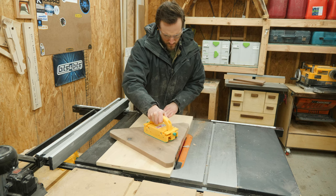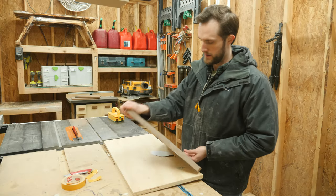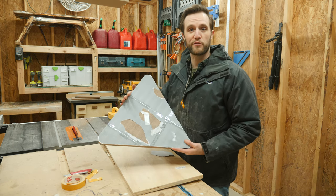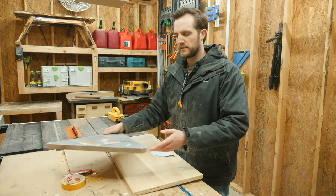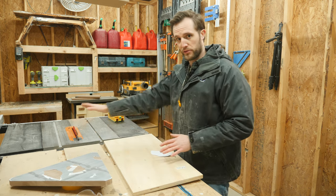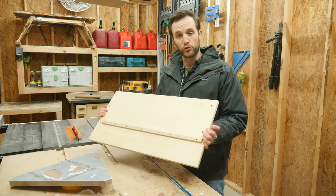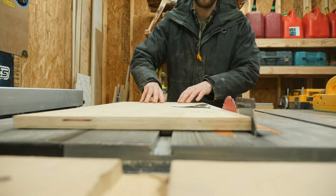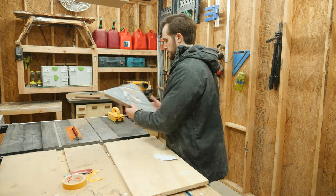Then just run this contraption through a table saw. So it's good to go. Good to go. So that gives me those perfectly straight lines I'm looking for on the edge of the tabletop. And if I didn't mention it earlier, I'm not running just a sheet of plywood through the saw for fun. I've actually got a little runner on it so that it sits in the miter slot, so it's nice and safe. But enough with that, let's get back to the project.